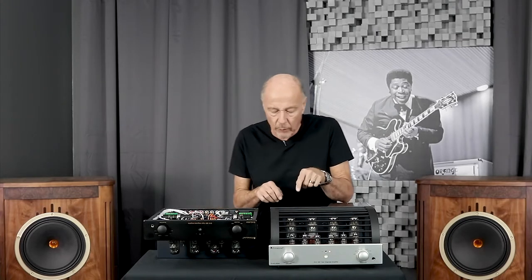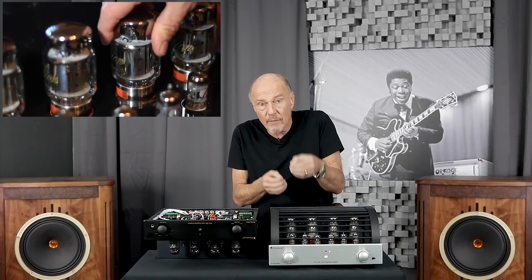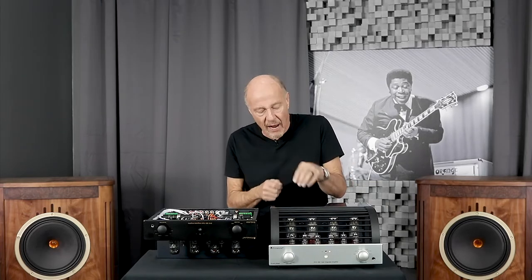There's a little red light right in front of the bad tube — it's going to tell you which tube is the problem. You simply pull the tube out and plug another one in. It doesn't even have to be the right tube. Adaptive auto-bias is so advanced I can run four different tubes in this amp — a KT-150, a 120, an 88, and an EL34 — and you'd never know I was doing the wrong thing. That's what I'm talking about. That's why I like engineering.